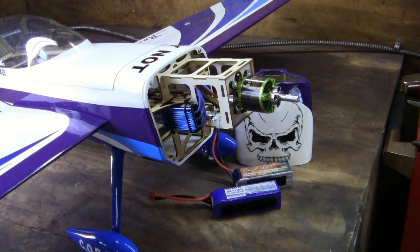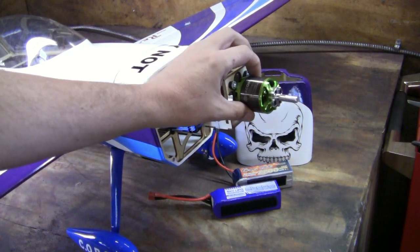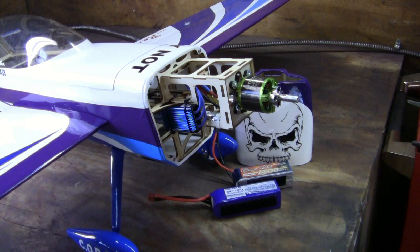The first thing you need to figure out is the motor — what motor the manufacturer suggests for your plane. This motor is one of the Bigfoot motors. It's a 0.32 size, 770 kV, and it's rated at 700 watts. I'm running a four-cell battery on this plane, which is 14.8 volts. The way you figure out amperage from your motor — sometimes they won't give you the amp rating, sometimes they will. On this particular motor they do rate it at about 43 amps, but that is at a 92% efficiency rate.